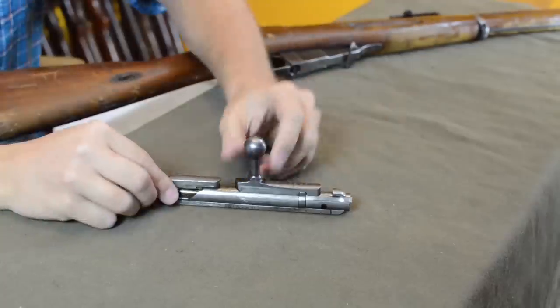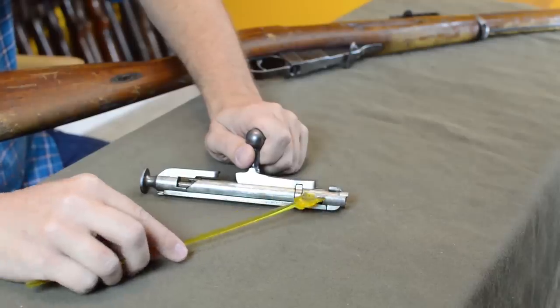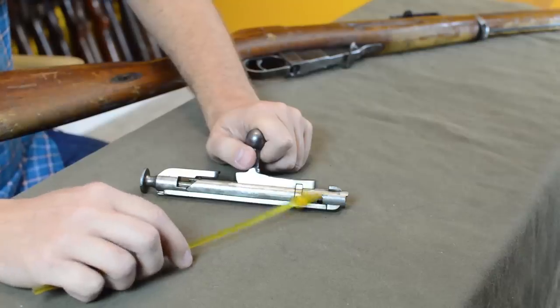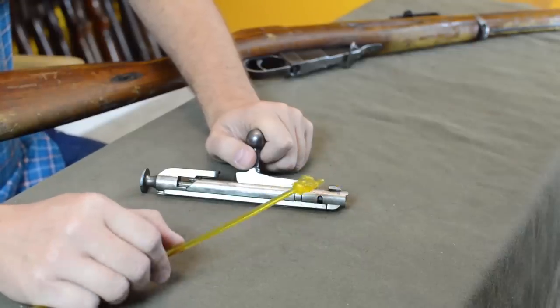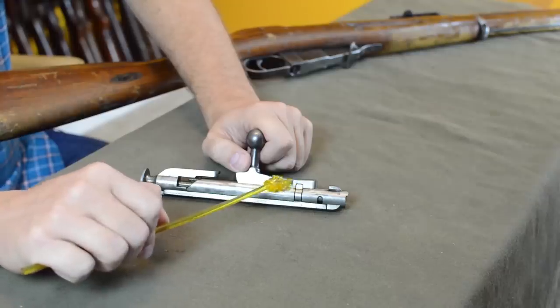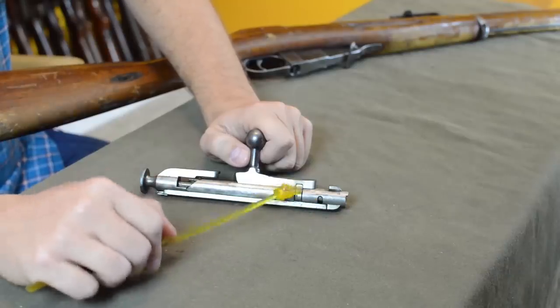Most of the blame for the problems in the system go down to the bolt, so let's take a closer look at that. The bolt has a separate bolt head. I happen to have for my show this patented plastic pointer so you can see. This bolt head is separate - this adds some strength and some interchangeability to the system, and it seems like the Russians were fixated on it. I'm going through the development of the gun right now very slowly in Cyrillic, and a separate bolt head was throughout the entire development process. What they did, in controlling the separate bolt head - unlike, say, the Gewehr 88, which controlled it internally using the firing pin - this is controlled externally. It's locked over by this component right here, this lug that comes out over and down, and see this little guy right here? That's what's going to retain our front end. This part becomes a problem.